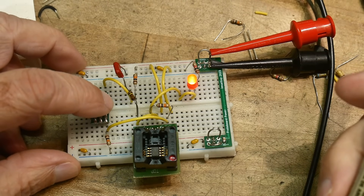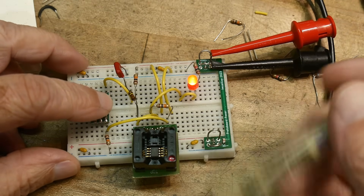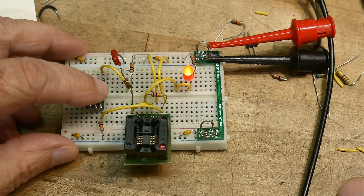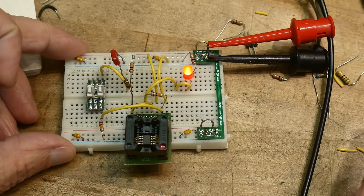A little on-off switch using just one package that has both the P and N channel. It's real low resistance — about 0.1 ohms on — so you don't drop a lot of voltage here. It's a great power switch. You could run about 2.9 amps through it, so you could power up all kinds of cool stuff with just a little on-off button.